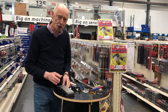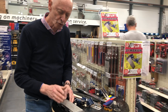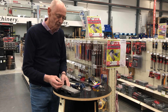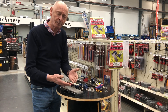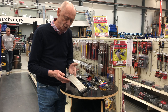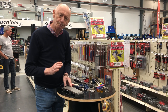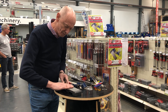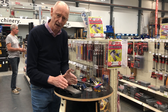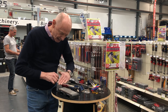I'd like to show you a diamond sharpening pad. Traditionally these used to be made out of stone for sharpening chisels, plane blades, and knives, but over the last few years they've introduced diamond sharpening pads. The main benefit is that the surface remains dead flat all its working life, whereas with a stone this can become hollowed by the action of the chisel.